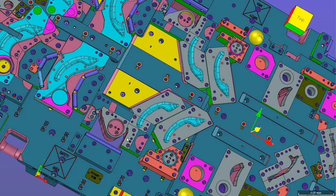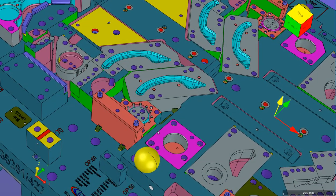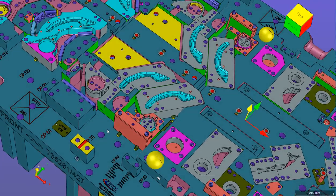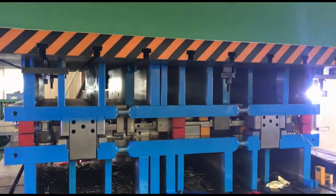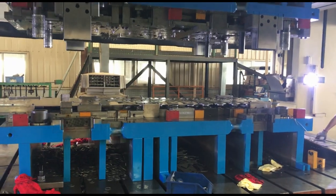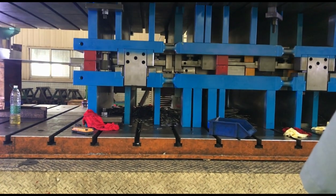For that setting you must have part, strip, or coil throughout all stations. When we have the coil on all stations there will also be upward thrust. We always check the stop blocks when there is a part on all stations — in layman's terms, when the die is filled.